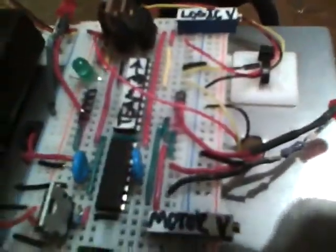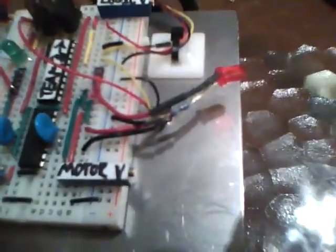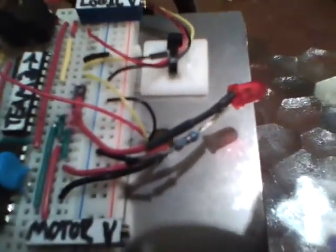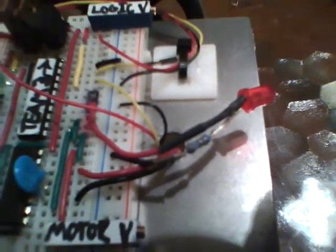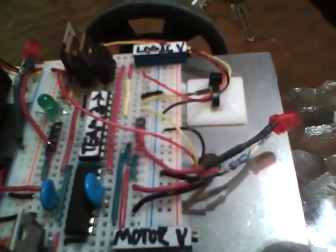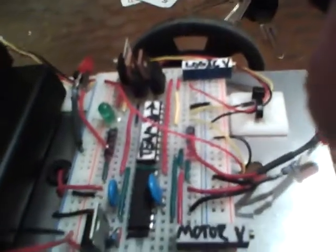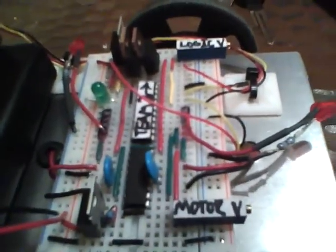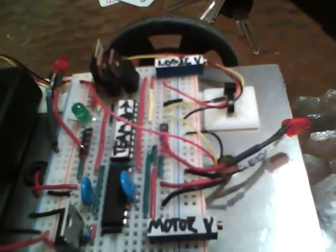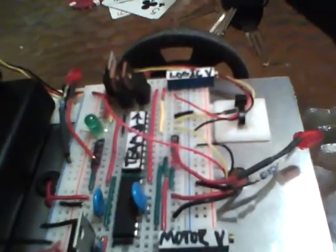Some other quick notes: I used LEDs to indicate when my sensors were being pressed, and I used the program to actually turn on that light whenever it was doing an algorithm. For instance, if you had two bump sensors and when those two bump sensors are pressed you had it turn right, you could also have it tell the two LEDs to turn on too, so you know your program is at that point where the PIC thinks both are pressed. This can help you troubleshoot a lot of times — using LEDs to see what the PIC is sensing.